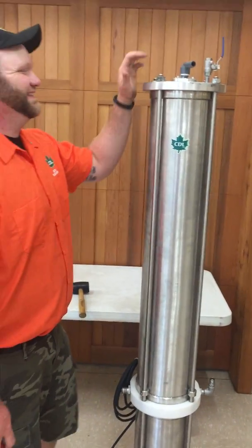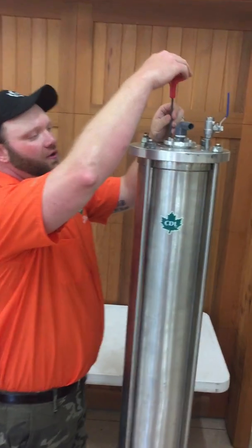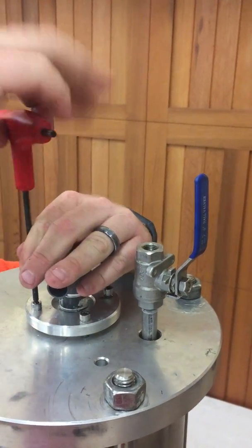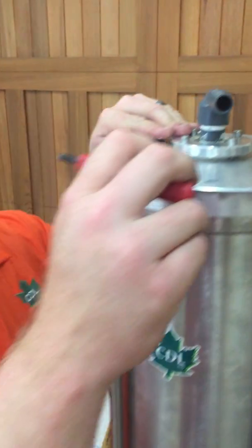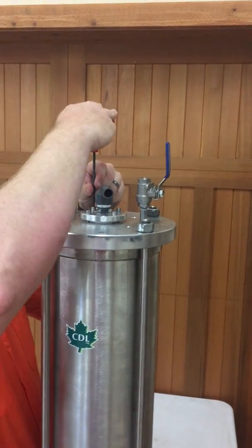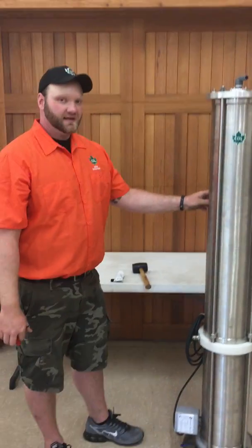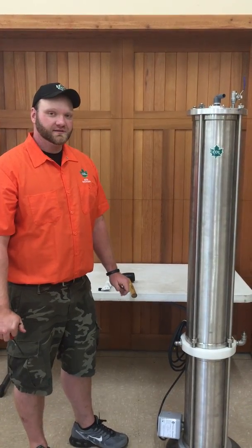Once your nuts are snug on the top of the post, go back to these Allen head screws and tighten them up a little bit. The more you tighten these, they're just going to keep going down. You just want to snug them up to make sure that your adapter doesn't pop out of your membrane under pressure, because there can be up to 500 PSI inside this post. Snug that up, still leaving a gap — enough where you can almost get your 3-sixteenths Allen head in there. There's no real set distance, just a nice comfortable distance. Once those are snug, you're ready to go. This is how to put an 8-inch membrane into a CDL reverse osmosis column. For more questions, visit our website at www.RossSugarBush.com.